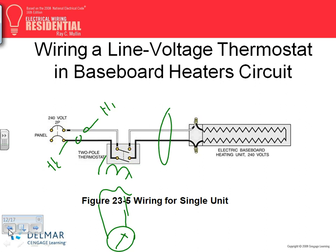This is a cable, guys. Typical cable, this is 12-2. I have a white and a black, but the black is hot, and I want to use the white as a hot. No problem. If it's a cable, re-identify it as black. Does that make sense? See that re-identification here? Commonly used.